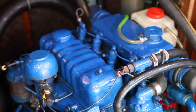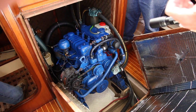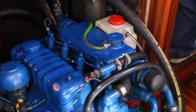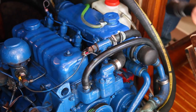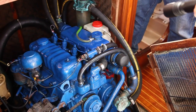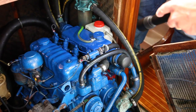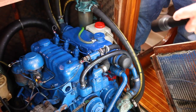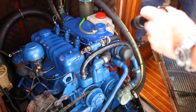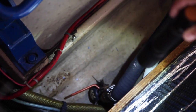Now let's talk about cooling in a diesel engine. Diesels are cooled with half water, half antifreeze in a fresh-water-cooled closed system — just like in your car. Here's your little cooling tank; it circulates coolant through the engine and returns to the cooling tank. On a boat, instead of a radiator and fan, we bring in cold seawater and pump it through tubes in the cooling tank through what's called a heat exchange system. Way down here you can see our through hull for bringing in cold seawater.